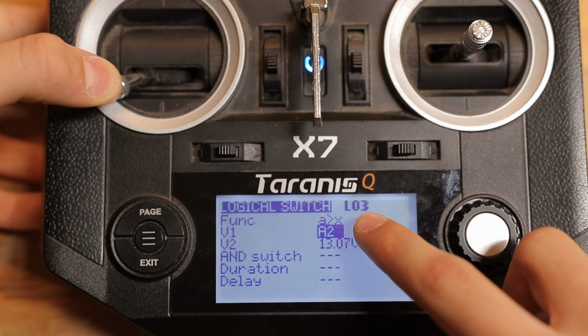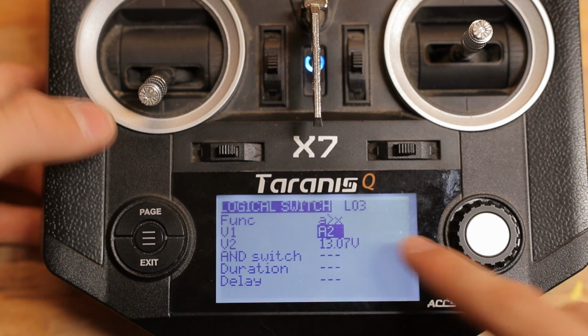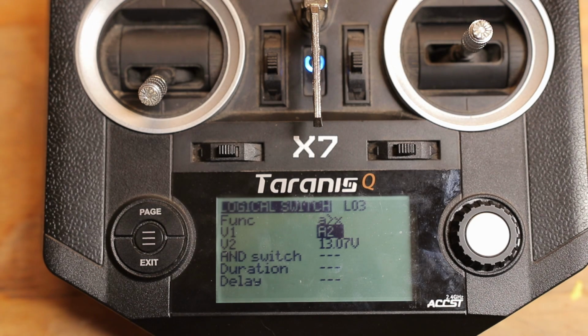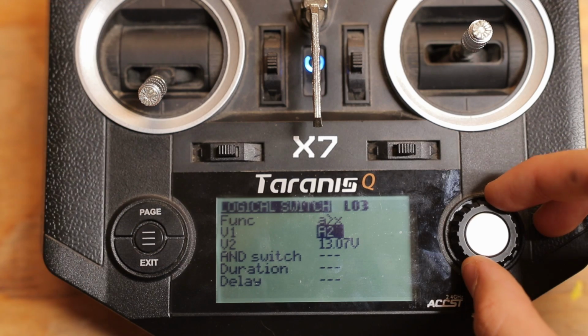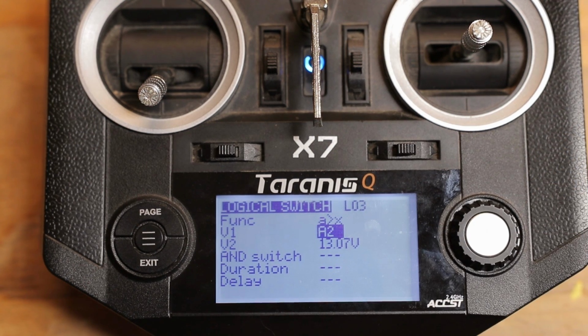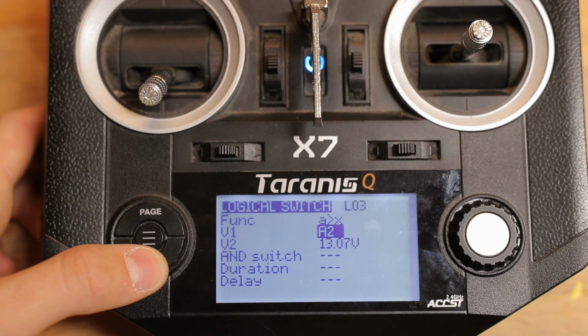And you'll see it'll go bold, which means it's true when we hold the switch, and when we let go, it's no longer true. So that means our switch works correctly. So that's a good test. Just connect your clips, turn it on, and if the text goes bold here when you flick the switch and goes away, doesn't go bold when it's not flicked, that means you have calibrated it or set it up well.